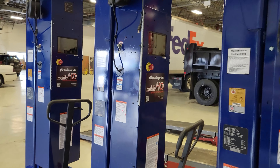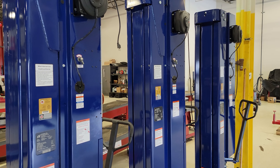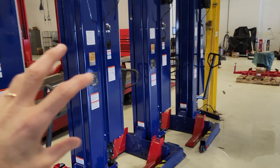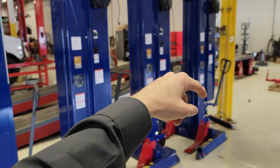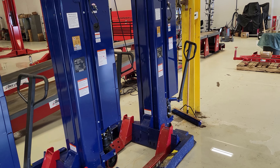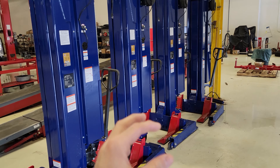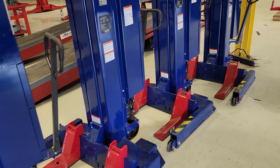I haven't personally used these too many times — we got them around July 2020, so about a year. These ones are 19,000 pounds each, so four thousand pounds more capacity than the red Rotary ones. A cool feature these have is that I can weigh the vehicle: with one at each corner it takes the weight at each corner, and with some math you can determine the total vehicle weight. If we have to do an inspection or a customer wants to know how much the truck weighs loaded with salt or gear, we have that capability.